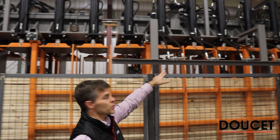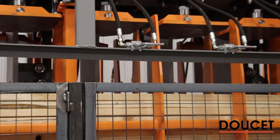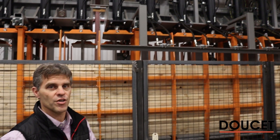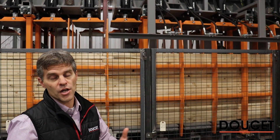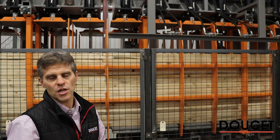You can see some cylinders with a manual handle. That means if you're doing a smaller length than what the press allows, you can close some cylinders so they won't be activated when pressing. This gives you a quicker cycle since not all cylinders have to be activated, and it avoids damage to the cylinders you're not using.